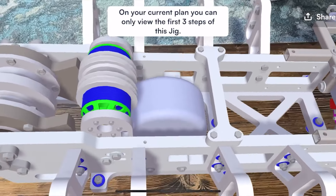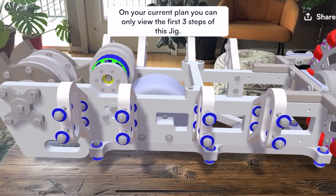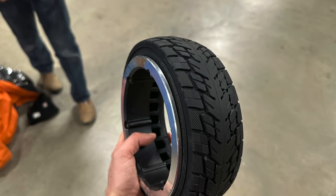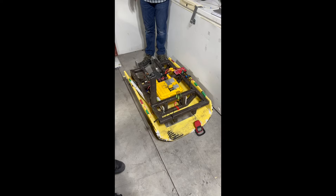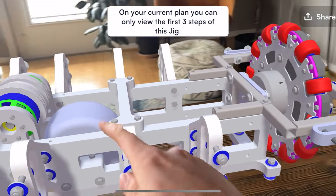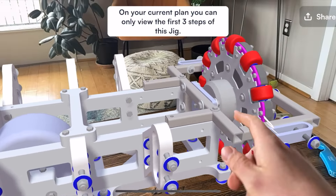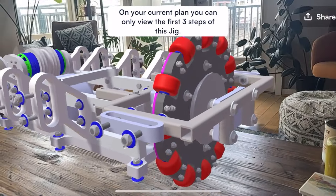While we're talking about motors, this cylinder is our placeholder for the front drive motor. The motor is going to be the same as last time, but we'll have a solid rubber tire instead of the pneumatic tire we had before, and our speed controller tuning for this front motor is significantly better than on version 1. The back motor is now the same motor as the front, so it's easier to have spare parts. And you'll notice it is now an omni wheel. Honestly, we were kind of bullied into making this a rear omni wheel — all the comments on the first version were like, 'Why isn't the rear wheel an omni wheel?' So now we have an omni wheel in the rear.